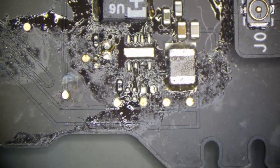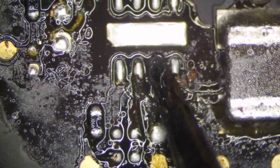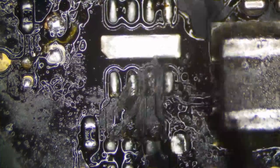See that pin right there? You don't want to leave that on your customer's board, trust me. That's why we don't really offer an ultrasonic cleaning solution, because anytime you see corrosion like that, it's going to need board repair usually. I used to do like $75 for cleanings, but no. Because this happens and...